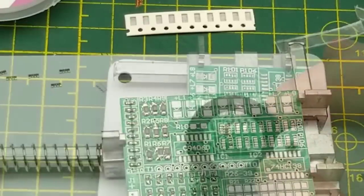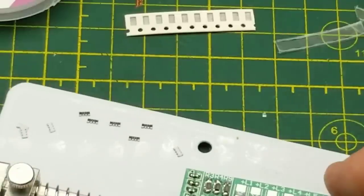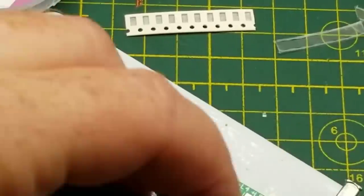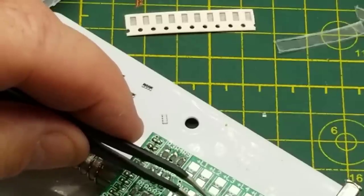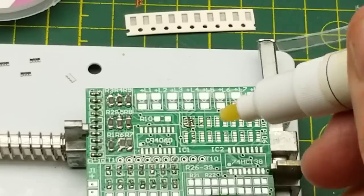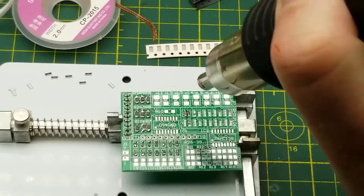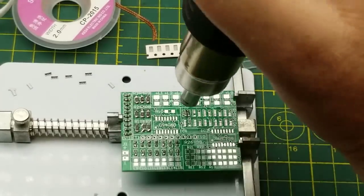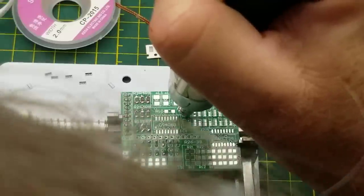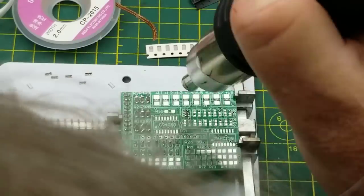How does that look - not lined up at all. I think what I'm going to try here is get some solder onto all of those pins and then drown it with flux - way too much, perfect - and then once it's all fluxed up get in there with the hot air gun and try and reflow it, hopefully the surface tension moves it into position. That's what usually happens when you're reflowing with hot air, isn't it?